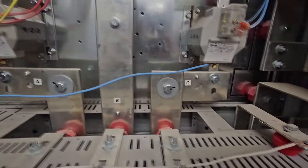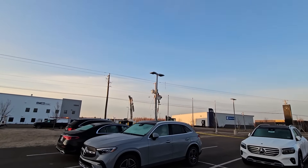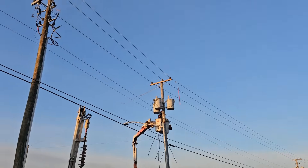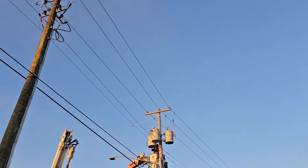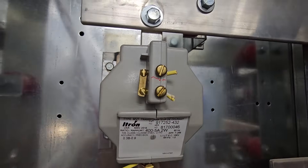There's going to be a different set of PTs and CTs being installed. I'll only be able to do that once the electrician rips all that gear out of there. So while I'm tearing this apart, we've got our two-man crew outside. They have power shut off now. They're going to dismantle that transformer bank and start getting that on the go, and I'm going to come in here and start ripping apart this wiring.